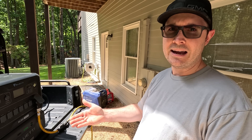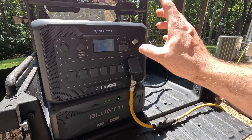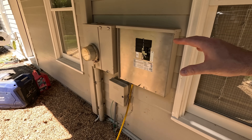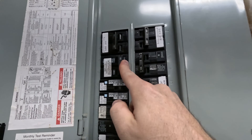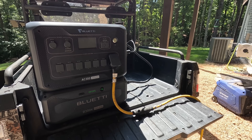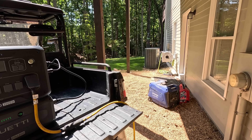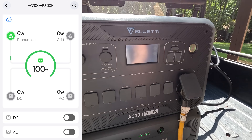I'm not running a four-ton air conditioner, oven, or clothes dryer — just the essentials. Historically using that gas generator I'm typically only using maybe half of its running watts when all the house essentials are running. One last thing before switching power over to the Bluetti: right now I'm on municipal 200 amp power, so to get down to 30 amps I have to go into my main breaker panel and shut off a bunch of breakers — the condensers for the air conditioners, the air handlers, the electric oven, the clothes dryer circuit, and any appliance with a dedicated high-amp-draw circuit. Everything else — zoned breakers for basic outlets and lights — can stay on.